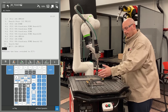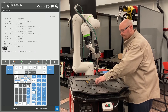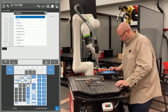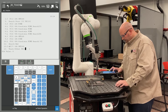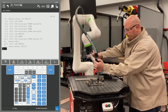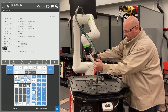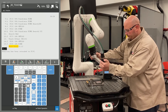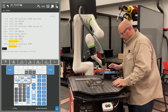The next motions I'm going to record are my approach, my weld start, my weld end, and my escape point — these are the points I would like to move with my part. In order for those points to move, I have to give the robot an instruction to offset those points. To do that, press F1 instruction, go back to touch sensor, and select touch offset. Now I'm going to use PR15 that I have in my program, and record my points as if programming the robot normally. I'll bring the robot to my approach position and record it, then bring the robot to my weld start location and record it with my weld start, then take the robot to my weld end location and record it with my weld end key. Now I'm going to teach an escape point and record that with the F1 point key.